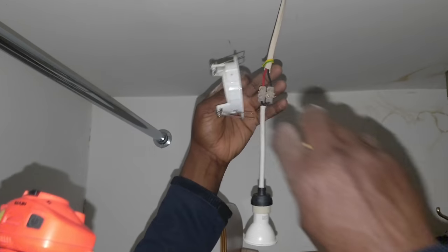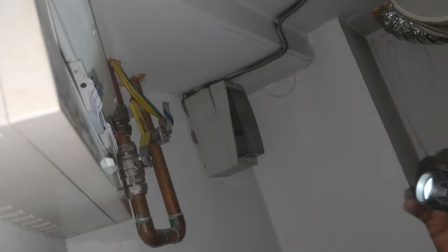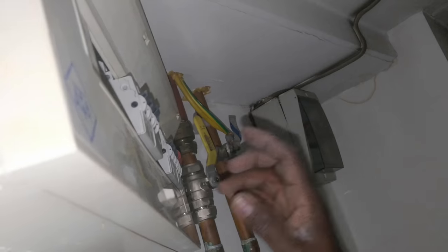This should be in one of those coffin boxes, or click boxes - a proper low-voltage enclosure. If they're not low voltage then you'd have them on RCD protection. If we change to 240-volt LED, we just take out the MCB from this side and put it on that side so it's protected. Or even better - fit an RCBO.